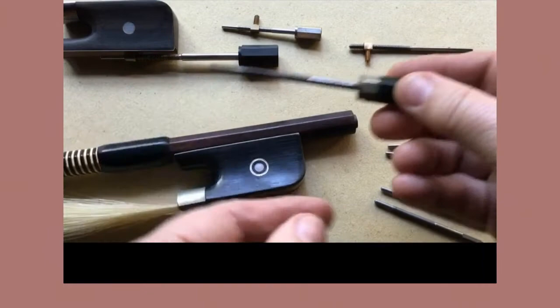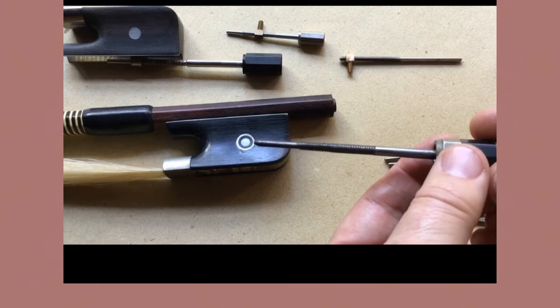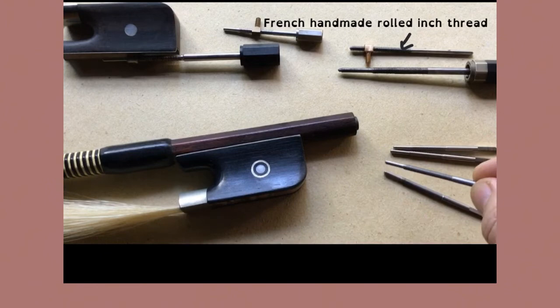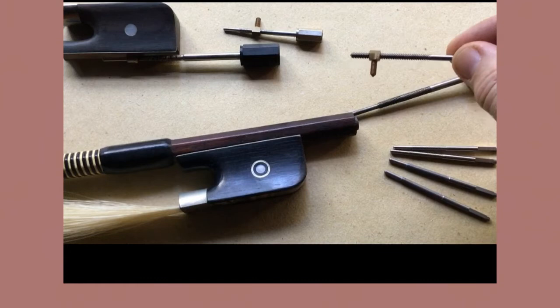Let's go a little bit into depth. The screw has a button on the side so you can nicely turn it. The screw itself is made out of steel — sometimes stainless steel — which is meant to be much harder than the brass eyelet it goes into. Screws come with different threads, being metric and most of the time imperial. The French have their own system, and even though they pioneered the metric system, they use the imperial system with a so-called rolled thread, whereas the others are cut threads.